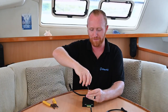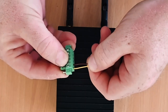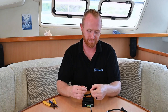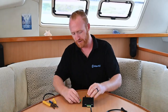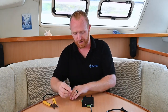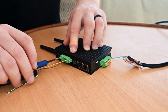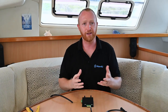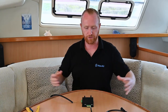You don't need to over-tighten — just enough that the connector won't come loose in larger seas or big waves. Give a little pull to check they're secure. If they do fall out, just loosen the screw and try again — it's quite easy. Once done, push the connector back into the side of Wayfinder, lining it up, and there it goes. This connector has additional security: tighten two small screws on the extremities to ensure it won't come loose on your adventure. With that, Wayfinder has all the data coming in it needs — NMEA 0183 older sensors and NMEA 2000 newer sensors all being fed into the unit.